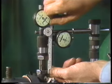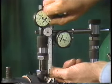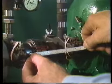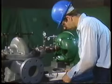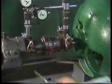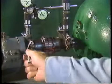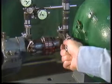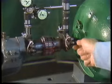While the brackets are in place, a tape measure is used to determine the height of the target bracket and the distance between both brackets. Then the measurements are written down. It's also a good idea to mark the shafts along the edges of each bracket so they can be reinstalled in the same place once the amount of bar sag has been determined.